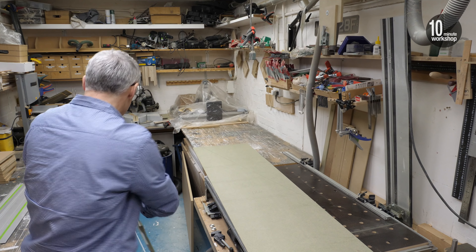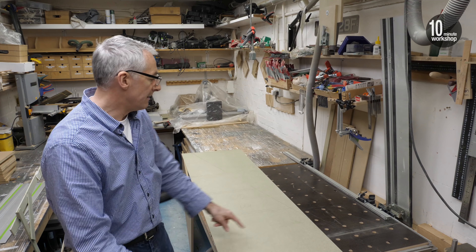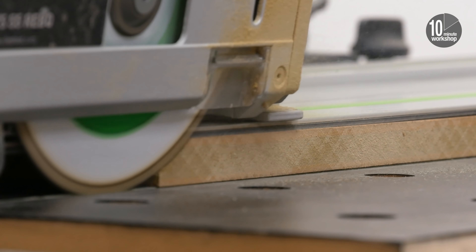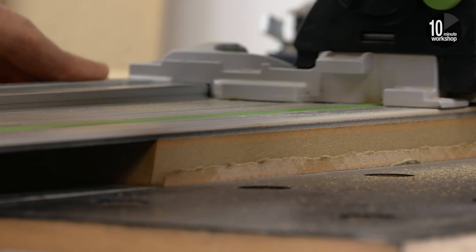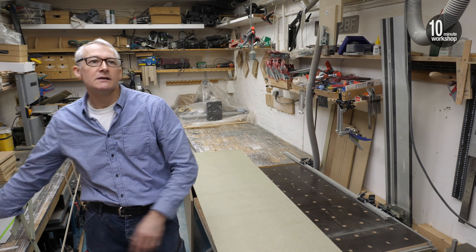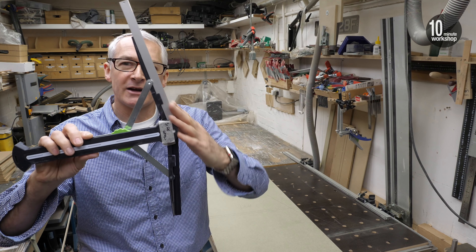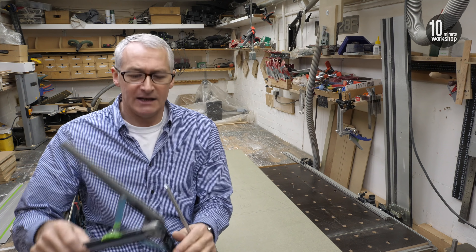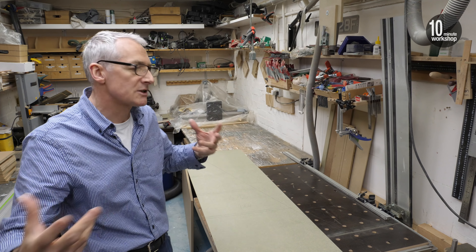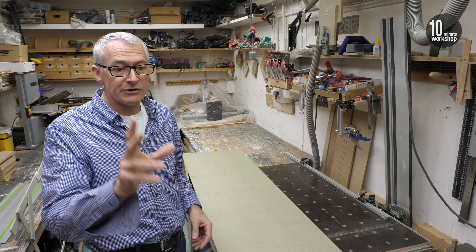What I need to do next is get these angled sections cut — they're going to be mitered, but not 45 degrees. I want to get the two long angled ones done first. I've done a quick test and it seems to work pretty well. I'm going to use Clamex connectors to join those two together — not because I particularly want it to be knocked down, but because it's a really shallow angle and getting a screw into either of those ends would be almost impossible. Even though it won't be seen, screws would be ideal, but the Clamex connectors are really effective and work very well.